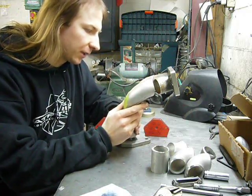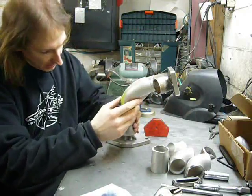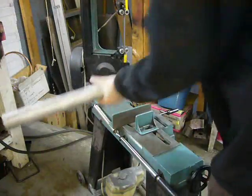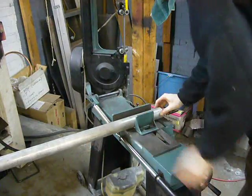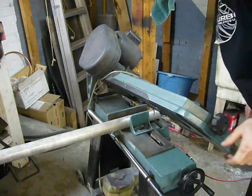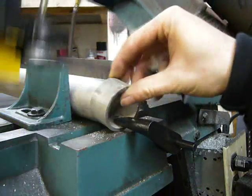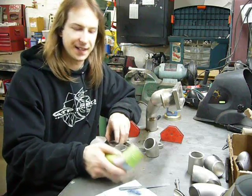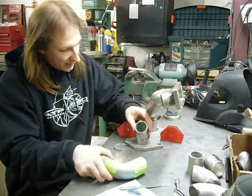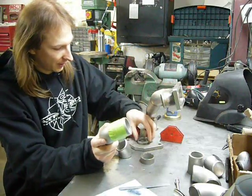Well, it seems my guess was pretty close. Now I just need to cut about an inch of runner for here and maybe another 3/4 inch on the bottom. It helps a lot when you're doing this to cut bits of pipe various lengths. That way you can try different combinations and make substitutions very easily without constantly running back and forth to the saw.